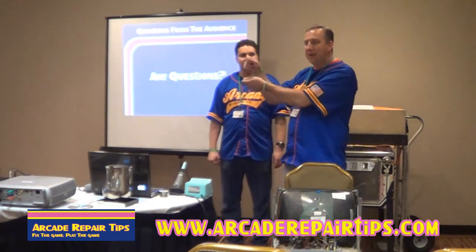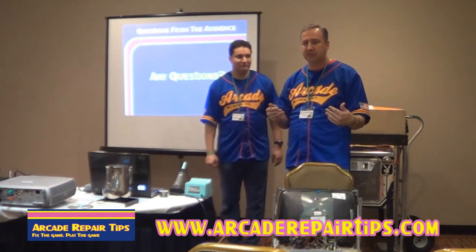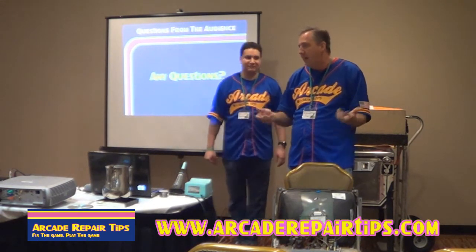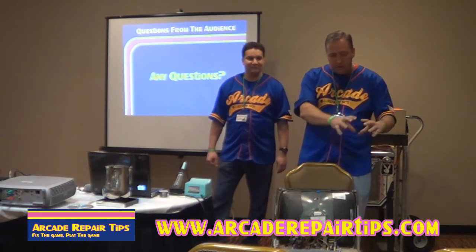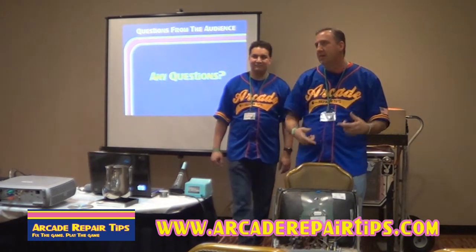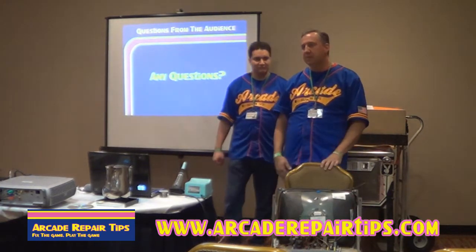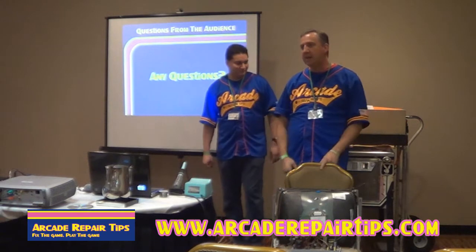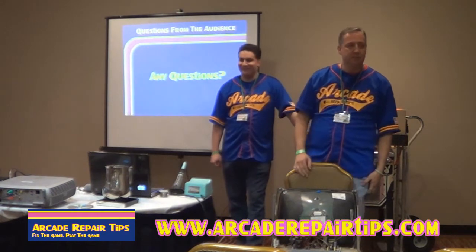So a lot of times if point A is good and point B is good, but C way over here is not good, I take a real simple approach to fixing games. I very seldom get out books of schematics and all this. I mean, I do. But at the same time, if it's good here, not good here, and around here is a whole bunch of caps, I'm like, I bet somewhere in this area, kind of like the power supply area in your monitor. So keep it simple, don't try to overthink it. But if you need help, that's what we're here for. We've got questions, we'll find some answers, and if we don't know, we'll tell you, but we'll find somebody who does. We'll ask Eric.